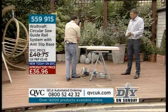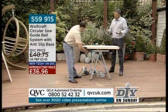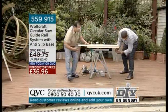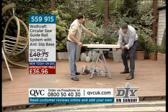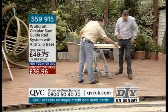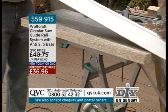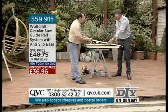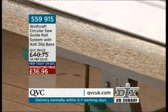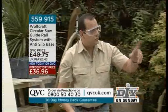Another thing: usually if you're cutting worktops you cut them upside down, because of the breakout. That's correct. Now this system here — if you look at the edge of this strip, you've got a proper factory cut. This is due to the anti-tear-out guide strip here, which stops breakout. Absolutely — it'll help you stop breakout and you've ended up with a proper factory cut. There is also a longer extension piece to this which we'll come to a little bit later.